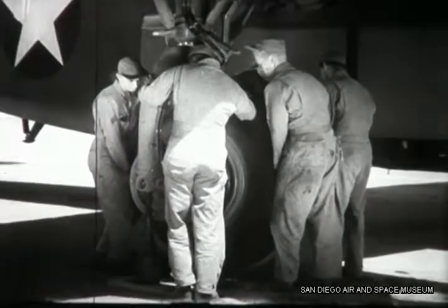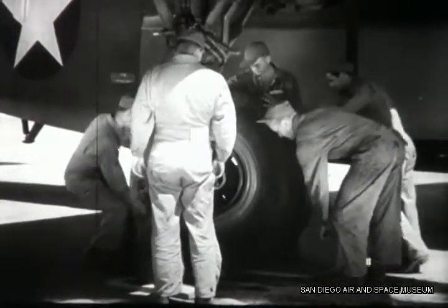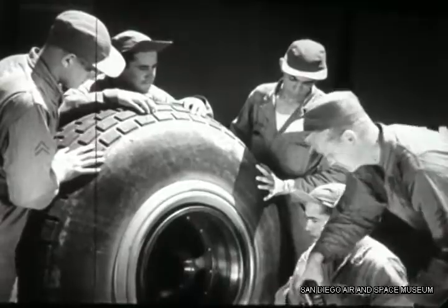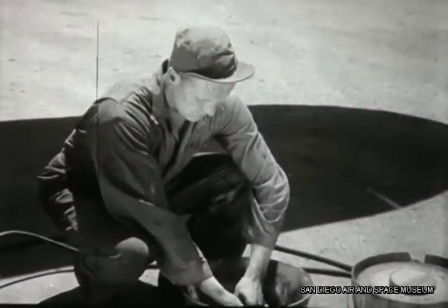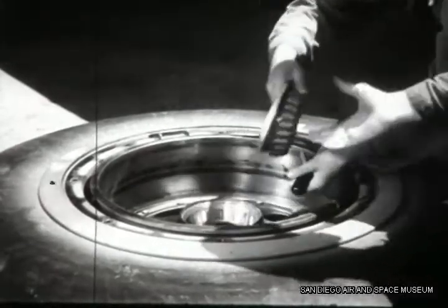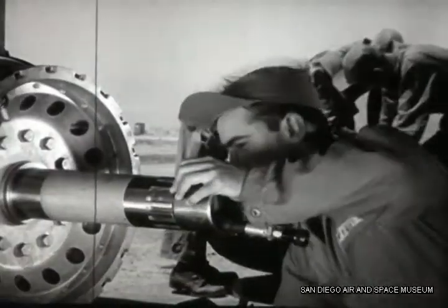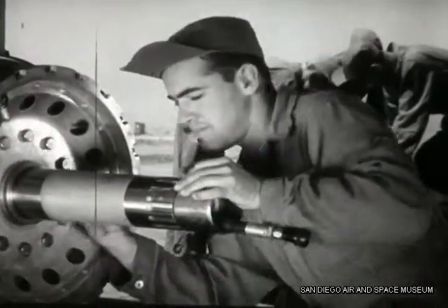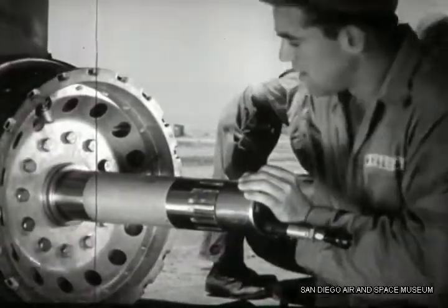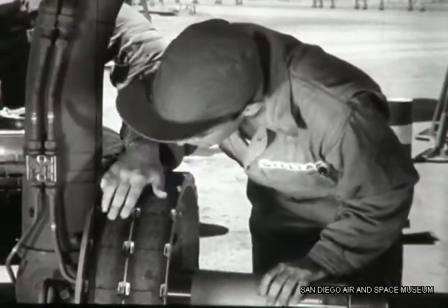A pretty large-sized gang is necessary to remove the wheel — it's a big one. Then the bearing is cleaned: Chandler puts it in unleaded gas to soak and goes back for the second one, taken out of the other side of the wheel. The axle is thoroughly cleaned, then Williams closely inspects it for cracks. He goes over the brake assembly for wear and general condition, but these expander tube brakes are never applied when the drum is removed or the tube will be ruined.